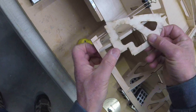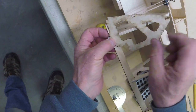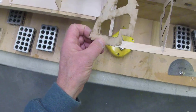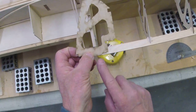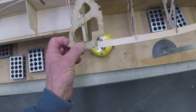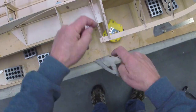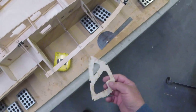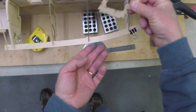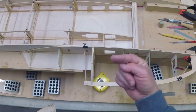You want to get to where your deck piece — this is our deck, isn't that nice — will come down and hit this material without running over the end. When all is said and done there will be a whole bunch of epoxy there, and then we'll sand that and make a nice little profile. This will actually become ever so slightly narrower than it is right now as we sand it and get it all configured into shape.